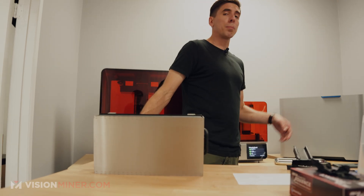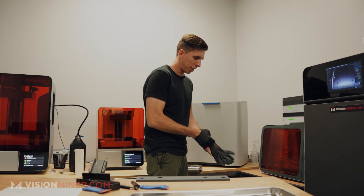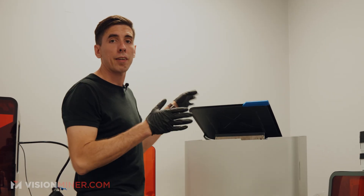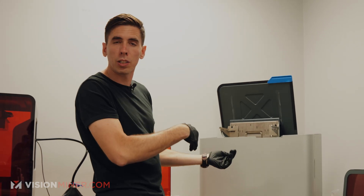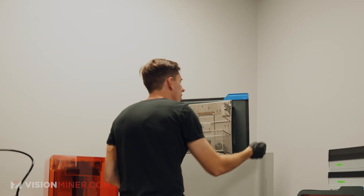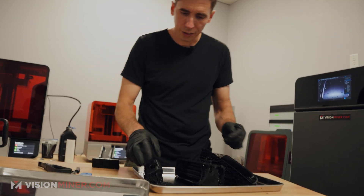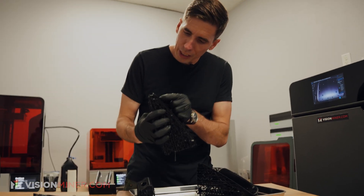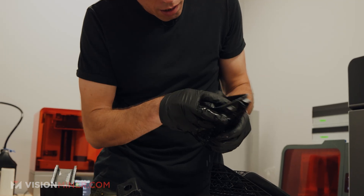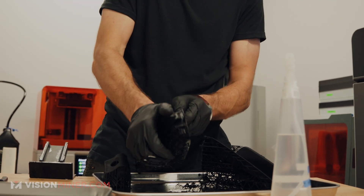Fifteen minutes left on the wash. We're going to stop it just a tiny bit early — 10 or so minutes is pretty much all you need. It raises up, then the platform tilts itself, which helps drain parts, but we can expedite that process. If you hit abort on the tilt, it sits tilted for two minutes. So we'll get these out. Now for support removal: I'm just going to use my fingers and snap all those little guys off — just get in there and crush it.